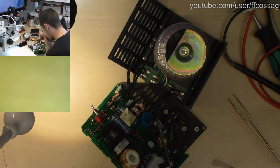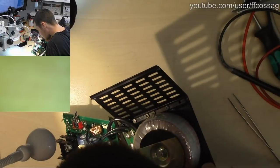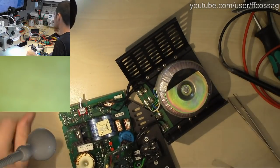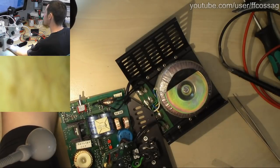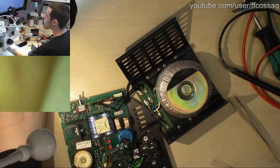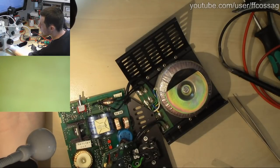What am I doing? What's on the other side of that? We have a B1645, which I do think is a diode. Switch mode power rectifier, probably from the Stone Age. Single diode. 16 amps. Nothing particularly interesting. Pretty high voltage drop.